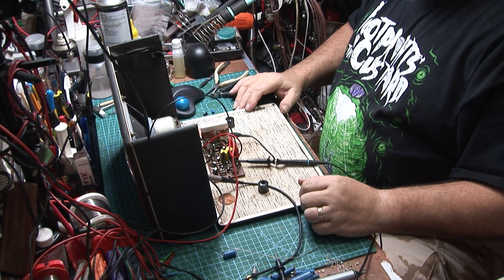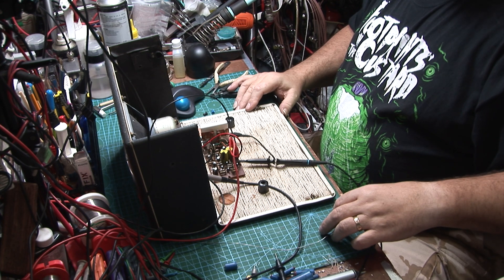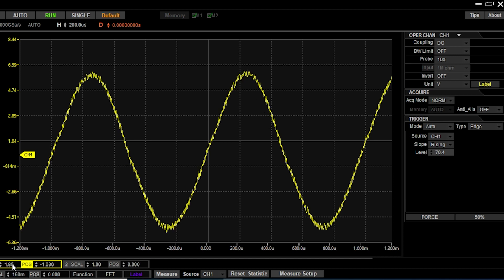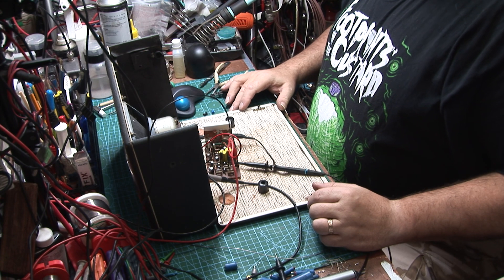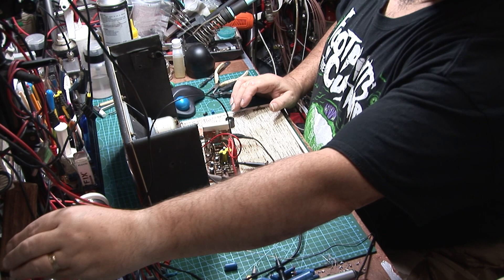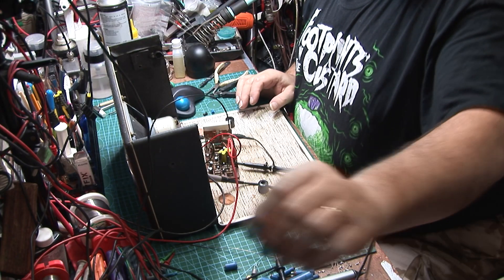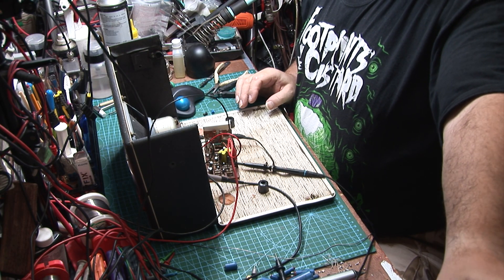Now we've got it together, we're set up, we're tested — let's put the signal into it. I'm starting off low at one millivolt to see just what the signal looks like. As you see, we have a much larger and cleaner signal. I'm going to turn that off and increase the signal to half of what it should be — it should be 26 millivolts for maximum output — let's go to 13.